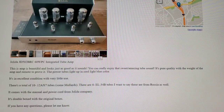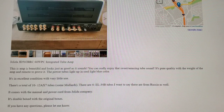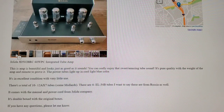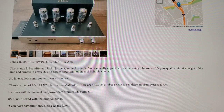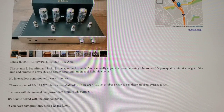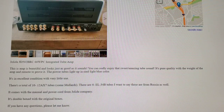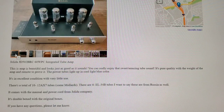I know how to go in this thing and modify it and change out the coupling caps and change out a couple things in the power supply in here. I used to live off modifying this exact amplifier. I sold a ton of them. And my whole shtick, instead of selling it, you know, like the guys I was selling against were all discounting and not making any dough. And I'm like, you guys are crazy, man. So I added stuff. I sold it at retail price, but I gave them more for their money. So I put in, you know, Audio Cap Thetas at the time, and I did some changes to the power supply, and man, you can make this little puppy sound so damn good.